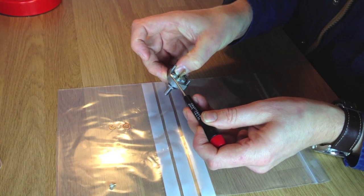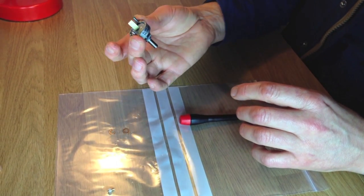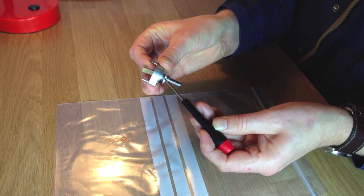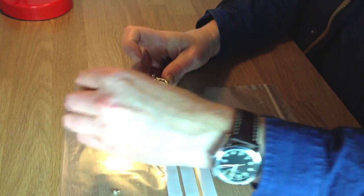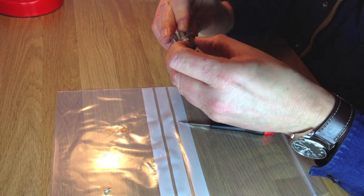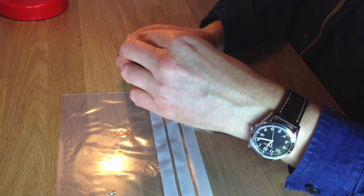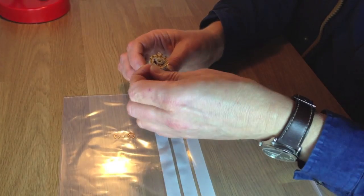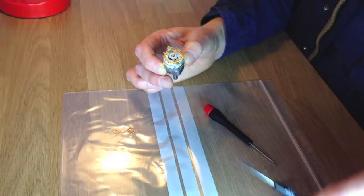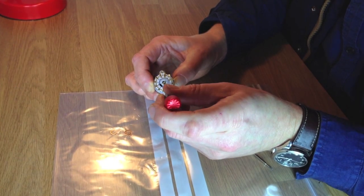Very important — they're lined up, so it's all good. Next task is to put the wafer back on. Remember, the key locator should be pointing towards you. The plastic part goes on first — this can be a bit awkward. While you're doing this, make sure you don't turn or push the shaft because the ball bearings will come flying out. Then this goes back on like that — everything's lining up. Screws in. You may find washing your hands is a good idea because your fingertips will be covered in grease and your tools will slip out of your hands.